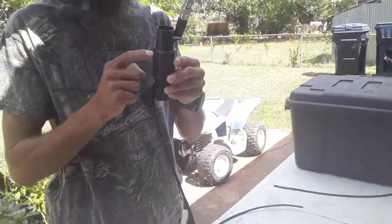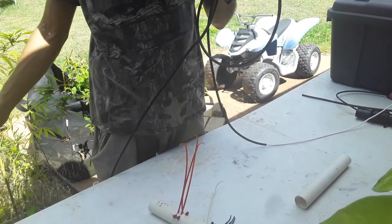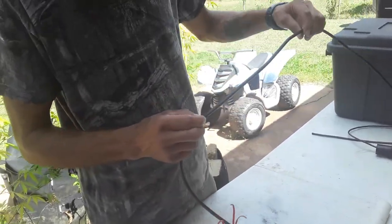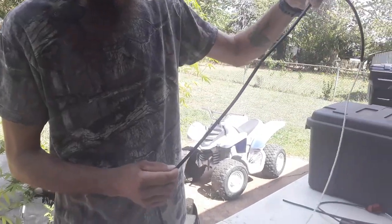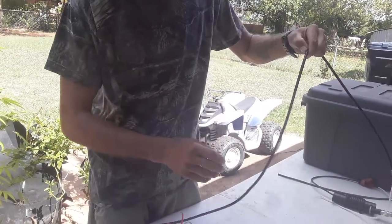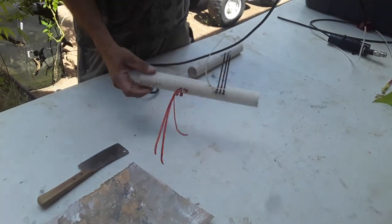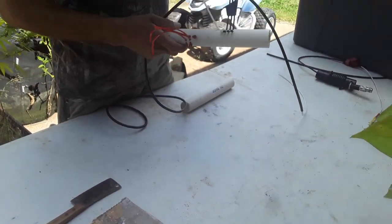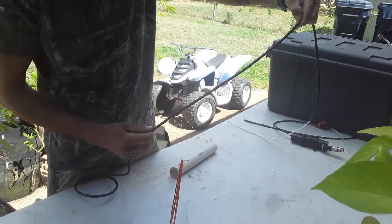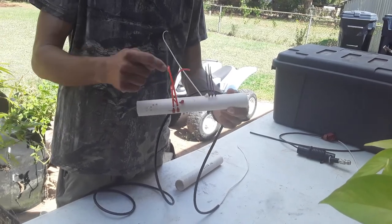But I start with the coil. Since I'm doing this antenna with the feed line included so that I have no breaks in the line where moisture can get in, I've went ahead and marked out the coil. So I've got my top element, my second element, and then my score mark is down here where I'm going to begin my coil. And I've measured out 116 millimeters for this particular former — that's what we're going to want to mark out.